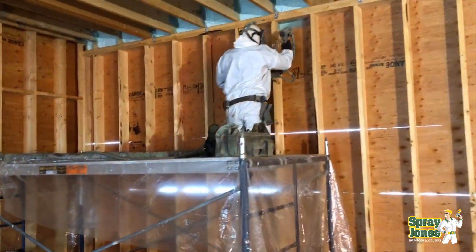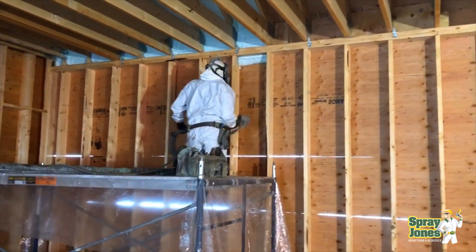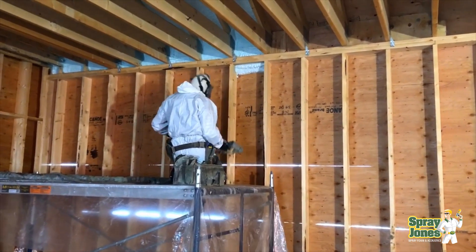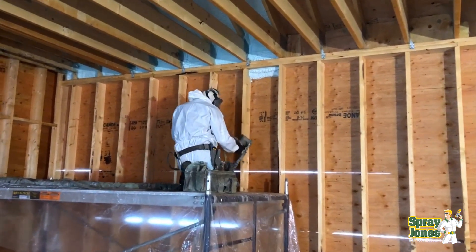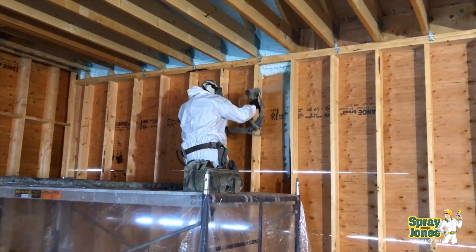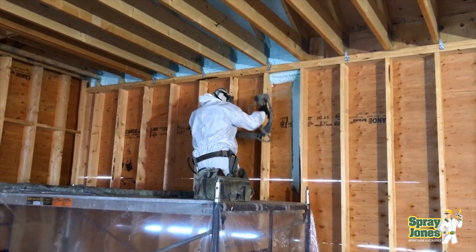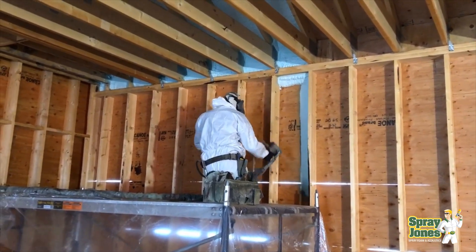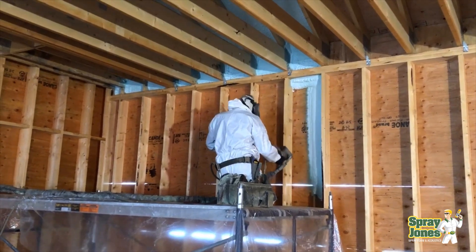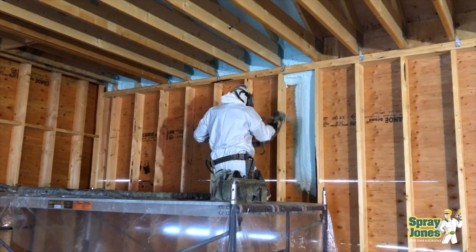And you're right — visually the plywood is dry. But we are spraying in a minus three degrees Celsius environment. It's a wood structure, a shop going up, spraying roof and walls. The heat is on and we're warming the structure up, but the air temperature and surface temperature hasn't come up just yet. So we're into a sub-freezing situation — about 28 or 29 Fahrenheit, somewhere in that range.